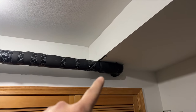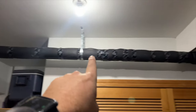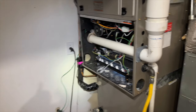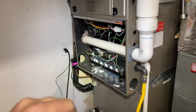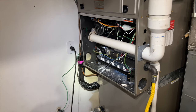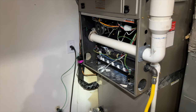We're back the next day. Completely redid this - had to make the hole deeper, got rid of those 45s, and now everything has a downhill pitch so the water will actually run back down to the furnace and through the drain. I also completed the candy cane piping on the flue. Anyway, it's a 90 or condensating furnace - hopefully this helps you out. Thanks for watching, make sure you like and subscribe, hit that bell notification, and follow me on Instagram and Facebook.